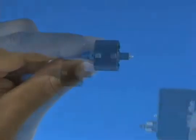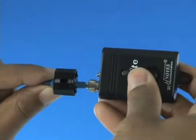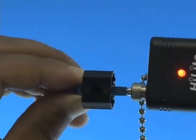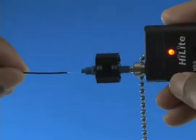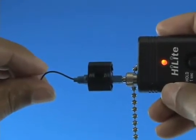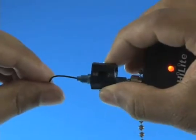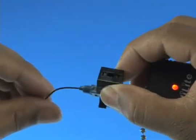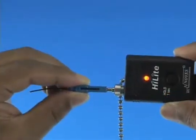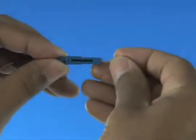Option B: Termination using a visual fault identifier. Remove the dust cap from the fast connector and insert the connector into the VFI. Turn on the VFI. There will be a red glow in position one of the wedge clip. Insert the cleaved fiber into the rear of the connector until the red glow dims. Make a bend in the fiber to maintain connection. Squeeze both sides of the wedge clip to release the wedge and discard the wedge clip. Remove the VFI from the connector. Place the dust cap back onto the connector.